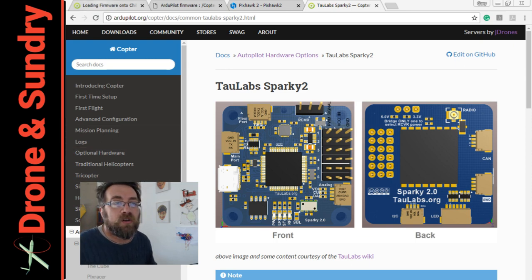So what do we need to do? And if you want the very latest and greatest hardware — so what's the point of this? I can play around with cheaper hardware that I might already — as in this case — have lying around. You might have an FPV racing drone you're a bit bored with. Well now you can pull it out, if it's supported, put a ChibiOS build of ArduCopter on it, ArduPlane on it, add a GPS and get all the good functions you might like. Stop buying the old 2.6, 2.8 boards — they are not good for you.